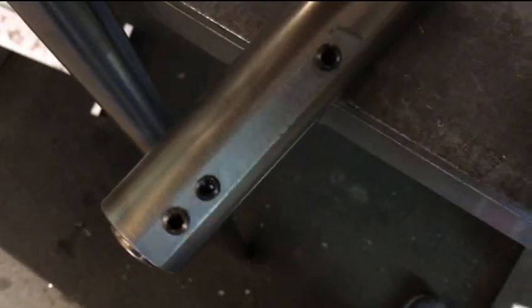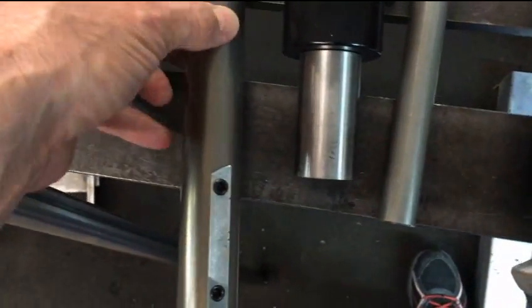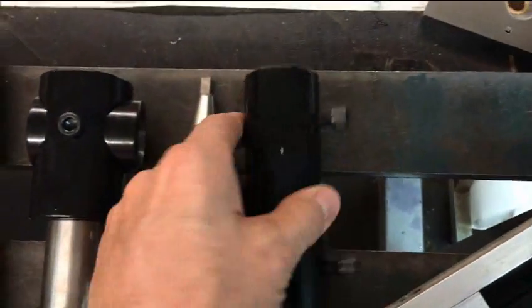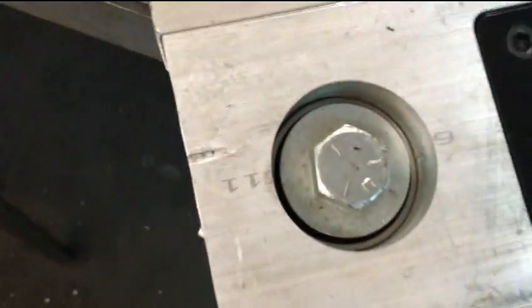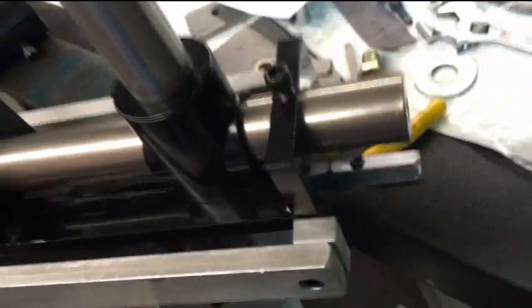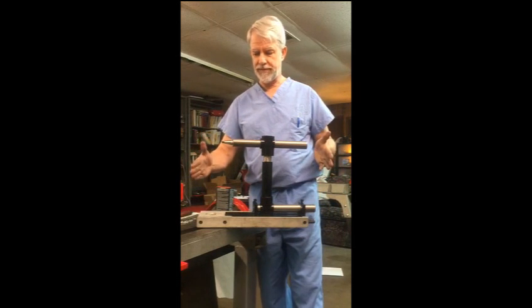Here's the cutting tool — that's a three-quarter inch bar. Here's the holder for the bar; it has a flat on the end, and there's an adapter in the bar that comes out for a half-inch holder. This part is mounted into this section, which mounts here, then the entire base is connected to the lathe with the attachment plate. The two bearings are already installed, and here's the adjustment feature to allow it to move in and out. It's set up for a large lathe — set for a 24–25 inch swing.